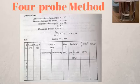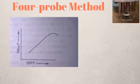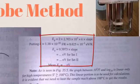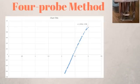Once the table is complete, plot a graph of log(resistivity) to base 10 versus inverse temperature multiplied by 1000 — essentially a plot of those two columns. You should get a curve like the one shown on screen. Find the slope of that line, using least-squares curve fitting if possible, then substitute the slope value into the formula to find the energy band gap.